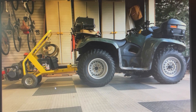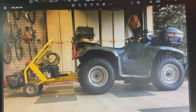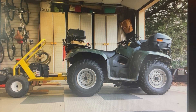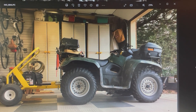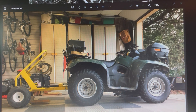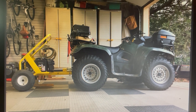I came up with using some front tires off of a Craftsman riding mower — they're six and a half inches wide and 13 inches tall, so they'll give me greater flotation on the sand and also raise the axle up another two inches for more clearance in the back. I searched around and bought a used set on Craigslist. The tires were dry rotted and the previous owner had squirted green slime sealer in them. I was skeptical, but they still hold air today after a couple of years.